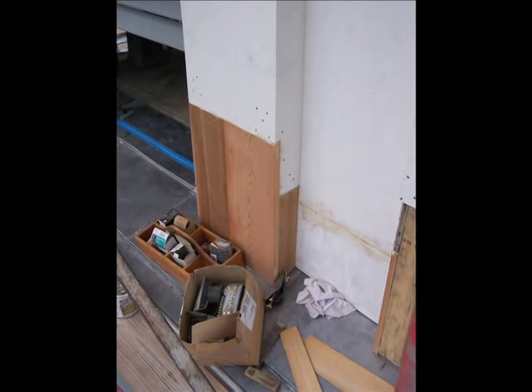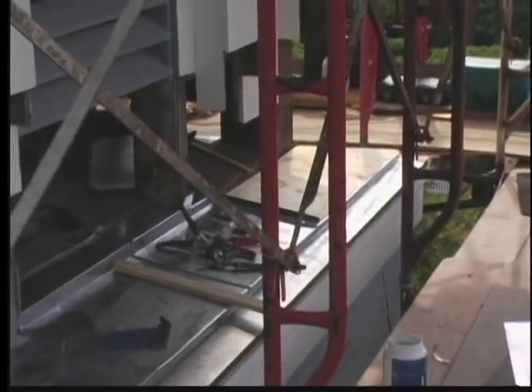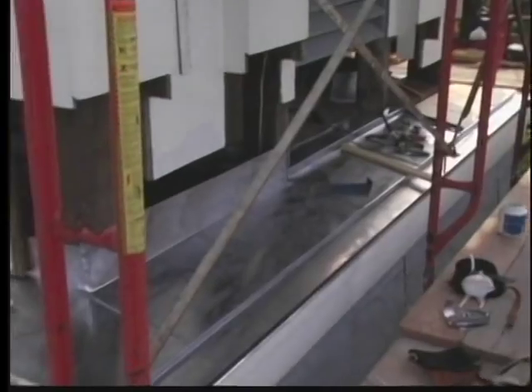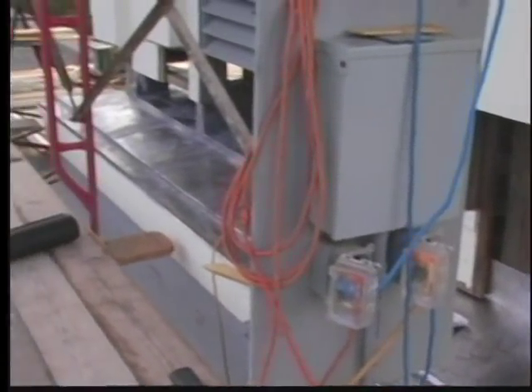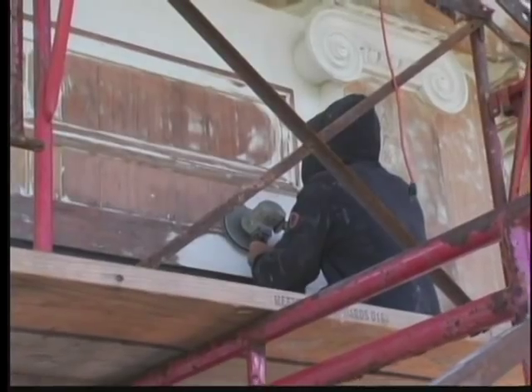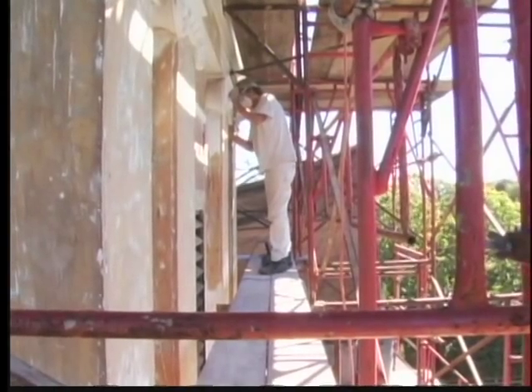Where you see the woodworking cut away — that's just cutting away rot. We cut back to what was good and put in red cedar, versus the eastern pine that was there initially. We refastened everything that we didn't replace to make sure everything was as tight and firm as possible. Every time you get a hurricane or a harsh winter storm, a certain amount of salt gets on the iron fasteners.